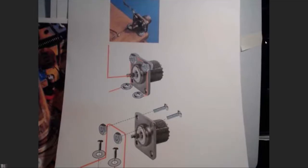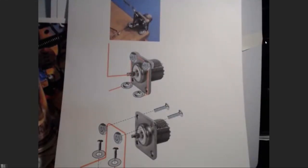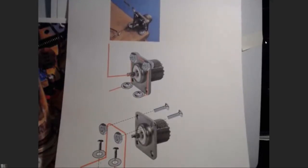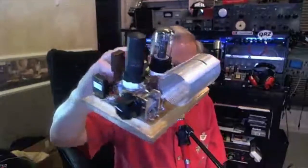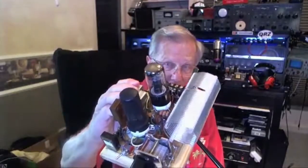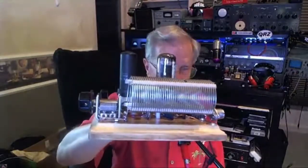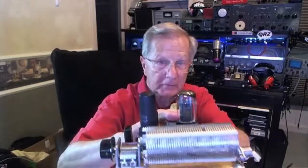One of the things we haven't talked about — and we keep reviewing a lot of this because everybody's not together, one's a little ahead of the other — is the coil. Very, very important about the coil. Richard and Gene and I talk about it just about every other day — what are we going to do about that coil? We finally got that nailed, and nailed really well. That's from MFJ. The coil that we have that you heard on the transmitter a minute ago, my coil, came from MFJ. That's the coil they use in one of their amplifiers, and they're making this coil just for us. This one's 41 turns — their coil for their amplifier is much longer.